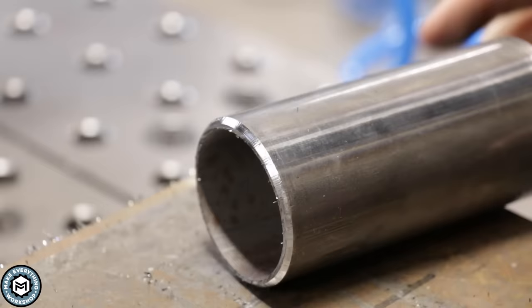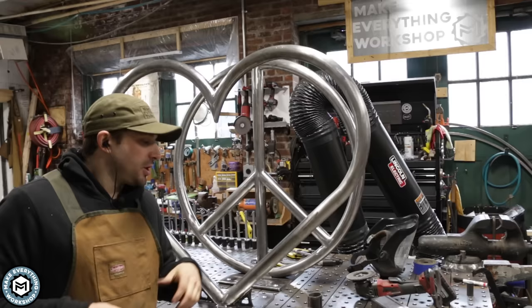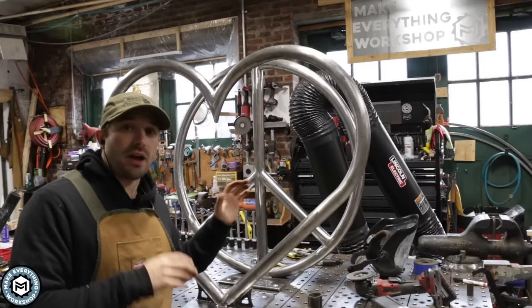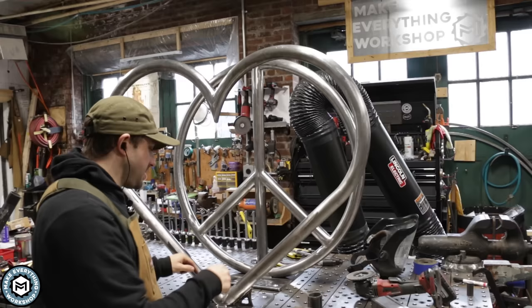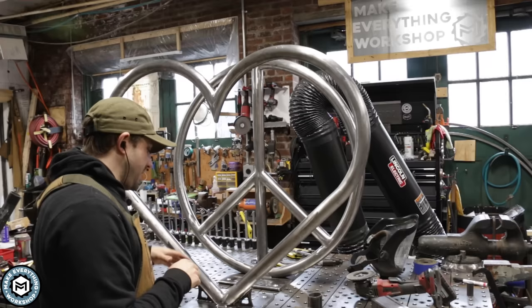Really fast, consistent chamfer on that piece. These are some bike racks that'll be in an upcoming video that I just finished — they're going out to paint now. When I made this one, it's shaped like a heart and I wanted to make sure it had proper support underneath it, so I made some gussets on the plasma table. To jazz them up and make them look nicer, I used the chamfer tool to dress all the edges, and I also dressed the edges of the plates these are welded to. I'll take you in close so you can see how those look.